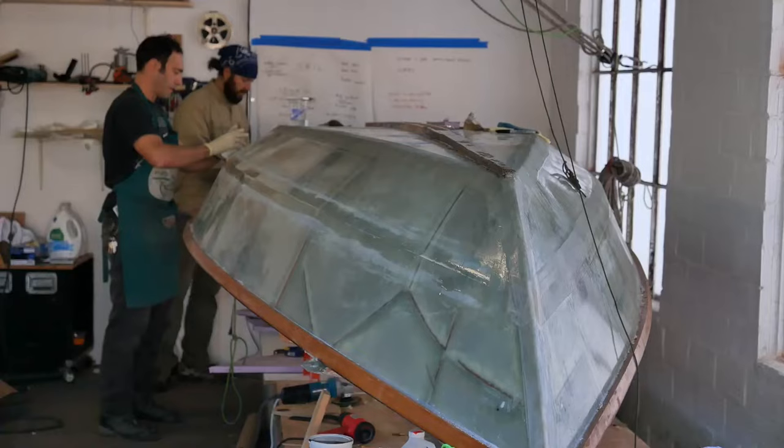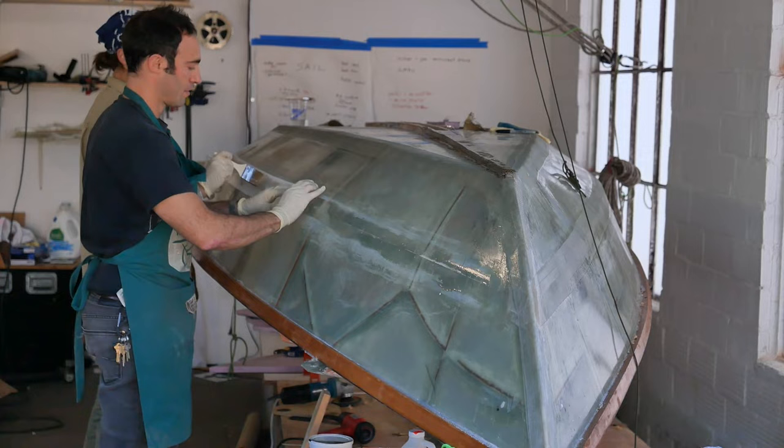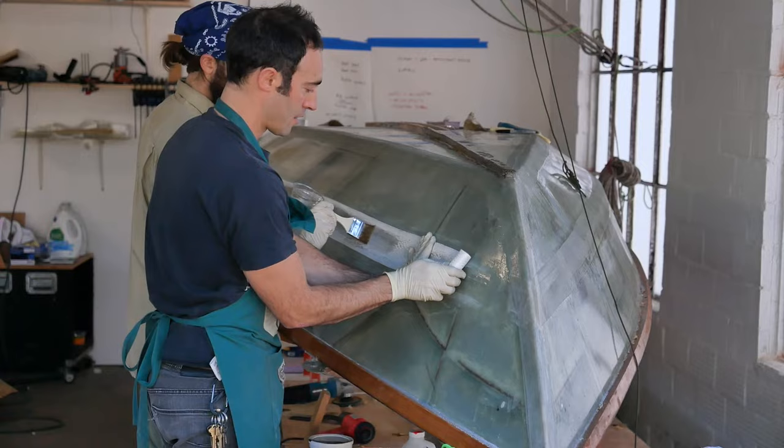Now we're rolling out some glass to tape up the chines. Look at how there's the stripe of wet epoxy over a light area. The light area is sanded G10. With G10, you always have to sand off the factory coating to get to a stronger bond for anything.